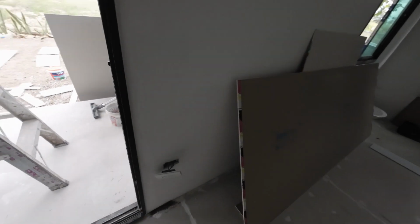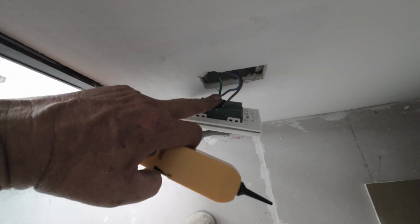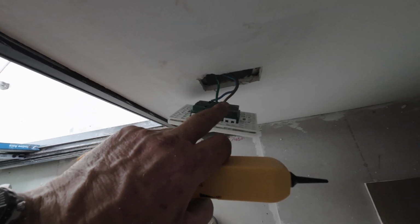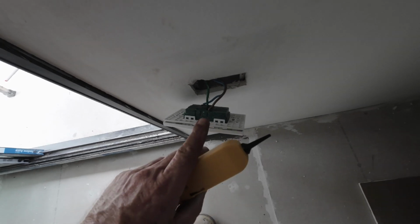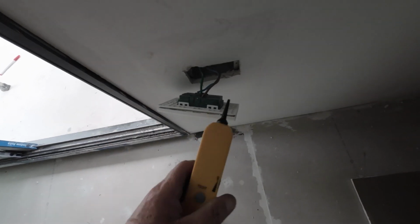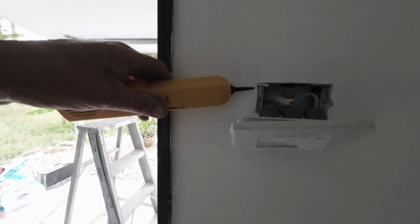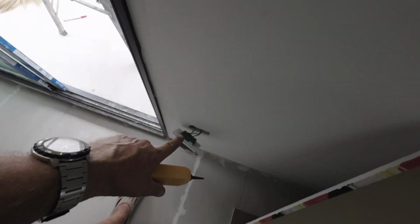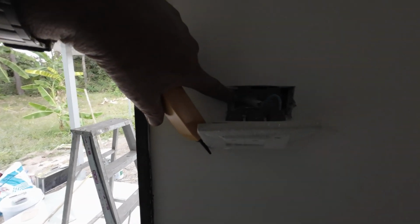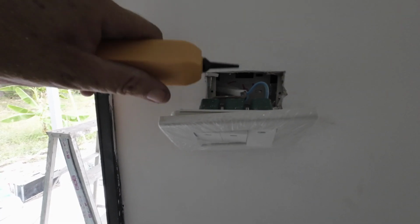Same for the lighting. I've got the back off here, so you connect the black wire to the ground and the red wire to the live. And you do the same on the neutral if you want to test which line's broken. That's how I knew I had a fault, because when I test, I use this. Again, you can follow it all the way up through. On this one, we've got the socket cable coming up alongside this box all the way up to a junction box up there. Again, if you want to test your lighting, you can do the same to find any faults.